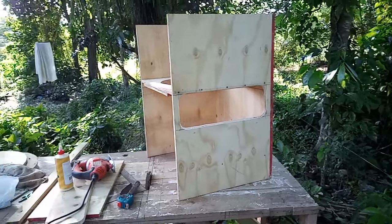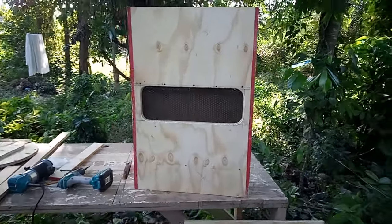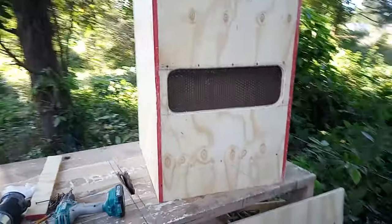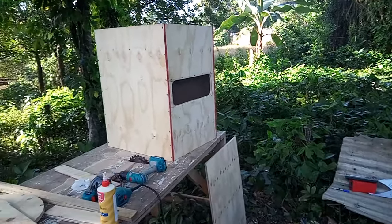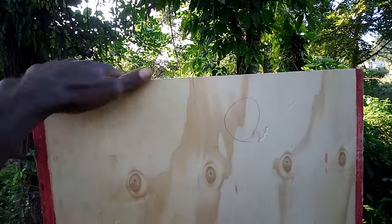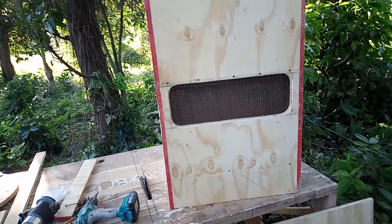This is how it's going to look. Just the port you're gonna see in the front — it's a fourth-order bandpass bass box. I need to test it tonight. Looking down into the bottom of the box you can't see the speaker because this piece of board guards it. The air is gonna come out here — up here is a sealed port, and the 18 is gonna mount from the top. If it sounds good I'll build the next one.